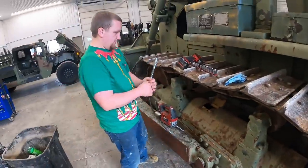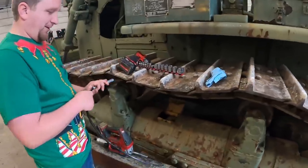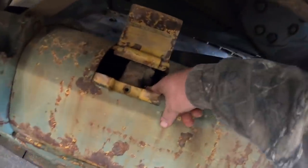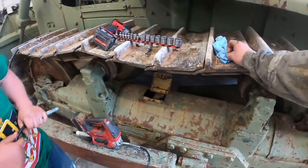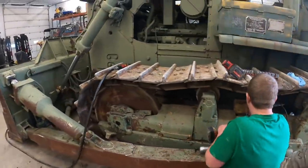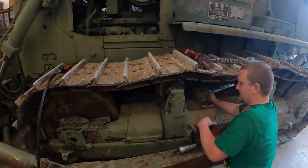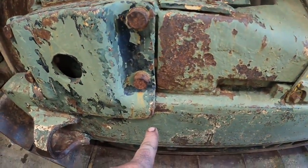All right, so Kevin greased up the other side of the track. Almost all your equipment and dozers have a little cover. Some stuff's different, but there's a grease fitting in there and basically a big hydraulic cylinder full of grease, and it shoves that front roller out. So he's going to tighten this up. We've got a little bit more sag than we'd like to see here. Usually like about 1.5 inches, 2 inches deflection at the most. You guys can see that moving up real slow.